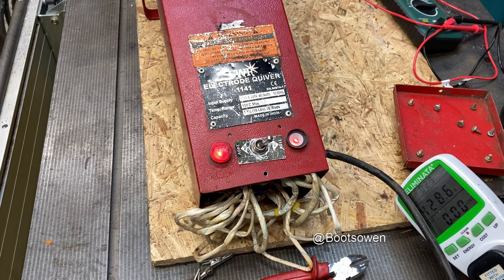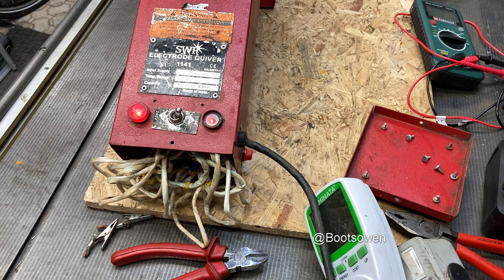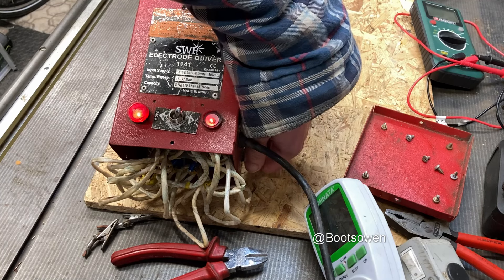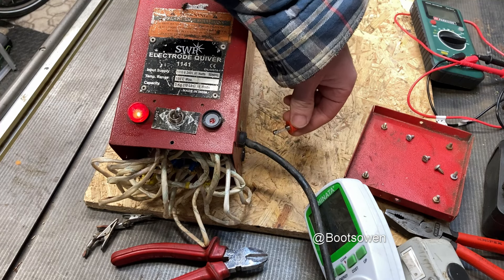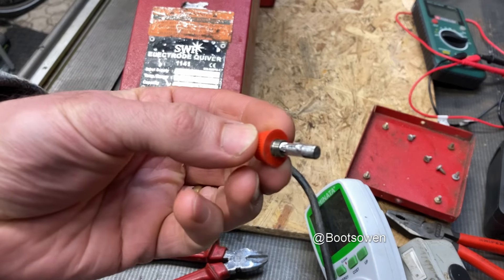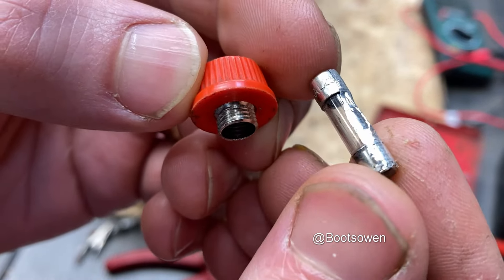So even if it was on the 110 circuit and I was giving it 240, my numbers say it should still only draw 160 watts, not three times that. There's a fuse on the side - that little red fellow - and somebody has soldered a bit of tinfoil onto the fuse. Let's try taking that out while live to see what happens. So there's your fuse with a bit of tinfoil soldered on - or maybe it's just pressed on over time.